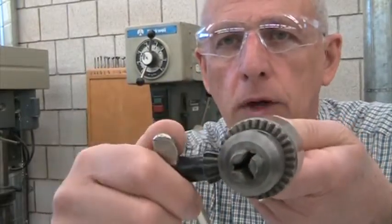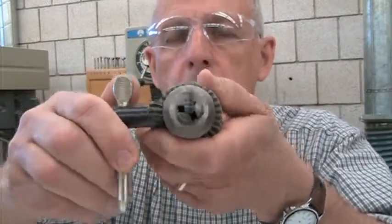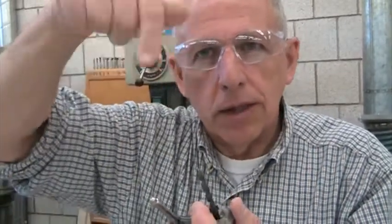With small drill bits, you want the bit to fit right in the middle and snug it down. Sometimes small bits can get sideways in the chuck, being grabbed by only two of the jaws and sitting crooked. What I like to do is put the bit in, turn the machine on and off once, and see if it's spinning true. If it's spinning erratically it means you're only grabbing it with two jaws, so loosen and readjust. If it's spinning nice and straight, you're in good shape.